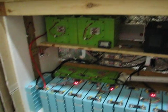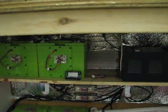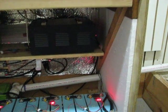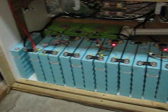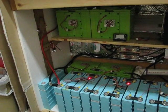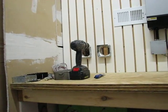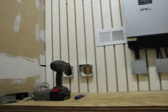The batteries are going to be air-conditioned and heated with the house. There's a vent right there that goes into the bathroom. This box is well insulated with half-inch styrofoam, pressure-treated plywood on the bottom, half-inch styrofoam, and the plywood is wrapped with roof paper — two on the bottom, one on the top — and that's for the second pit.